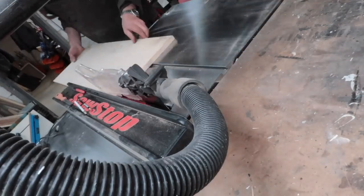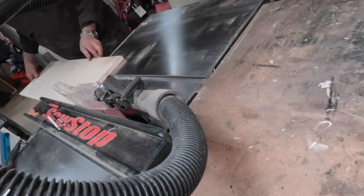Using my crosscut saw, I need five pieces because this is going to be four layers high and four drawers wide. When you have four individual layers you need a top and a bottom and then the pieces in between.